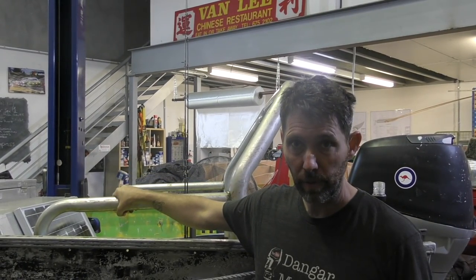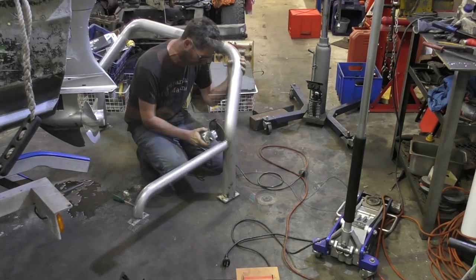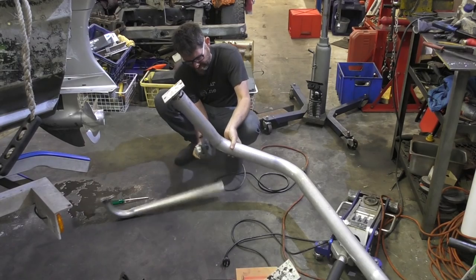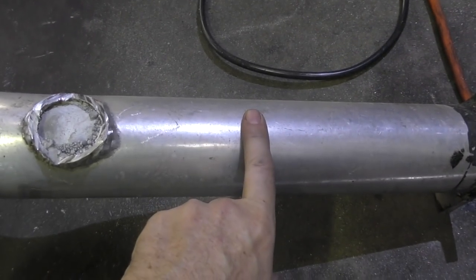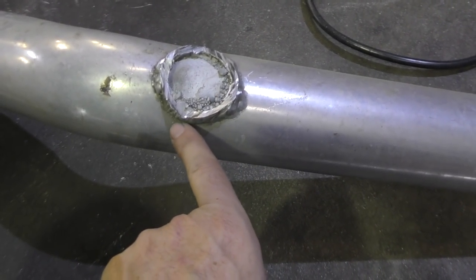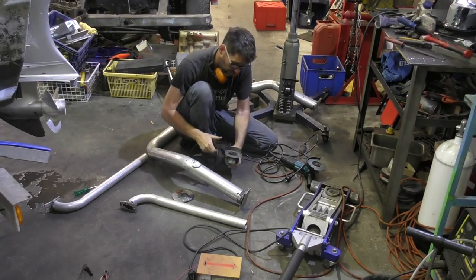So step one is I'm going to get out of the boat and cut these side arms off so I can weld them at a slightly different angle. My plan is to cut these off pretty crudely and then grind the rest off with a flap disc. When cutting these off, I've tried to preserve as much of the notch so it's easier to mate with the pole again, and it means I've got less grinding to do. There's actually a fair bit to get off, so I'm going to start with a grinding disc and then finish up with a flap disc.